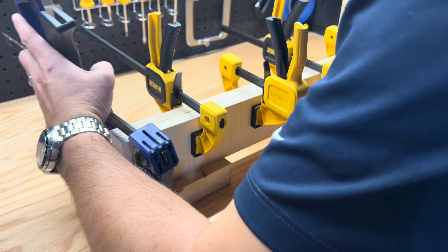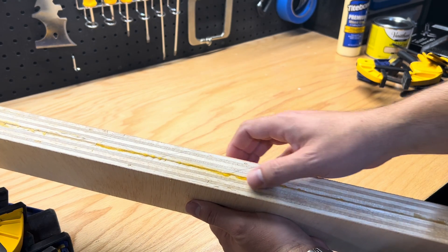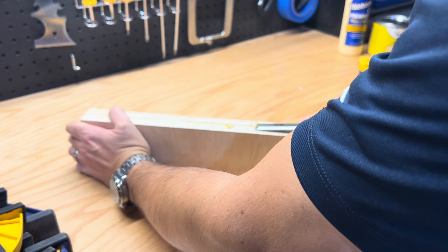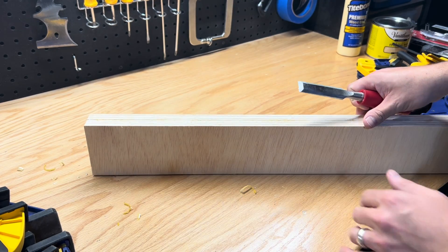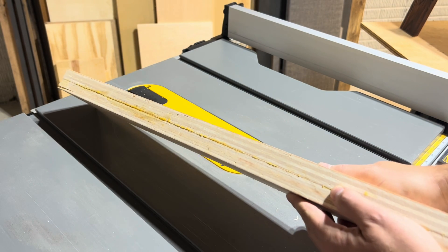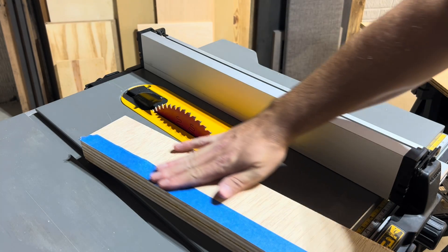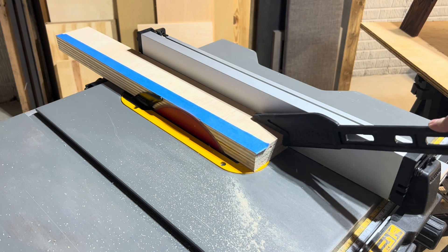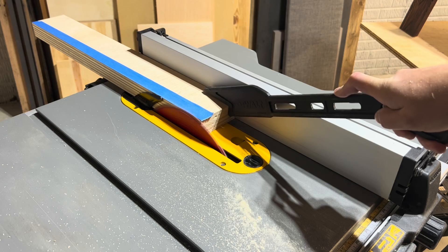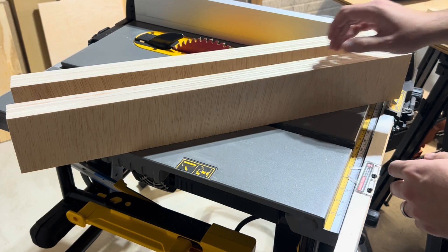The front and rear fence are next to be installed. Remove the clamps — some glue squeeze out is expected, which is fine as we have a nice strong bond. I used a chisel to quickly remove the glue squeeze out on one side of the fence and left the other side for the table saw to clean up. Raise the blade about an eighth inch above the stock and adjust the fence to take off a small amount of material to remove the glue and make it flush. Use painter's tape again to minimize tear out, then flip it and do the other side. Repeat for both the front and rear fence — afterwards both fences should be perfectly flush and even.